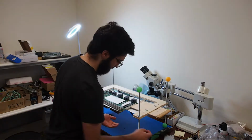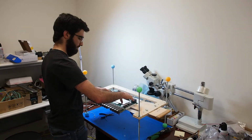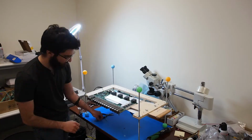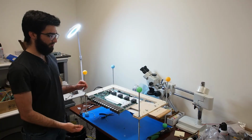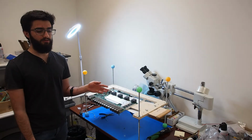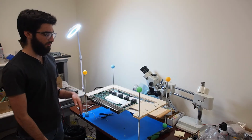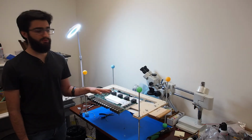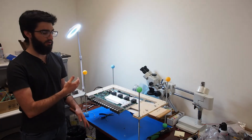Flipping the PCB is simple because the fixture can be easily manipulated by the frame and the PCB is held securely within it. Nuts are started on the screws that were passed to the PCB in the previous orientation. And now the nuts and the screws need to be torqued to the proper torque level using a torque wrench. In order to do this, we need to be able to access both sides of the PCB at the same time, so the PCB needs to be oriented vertically.